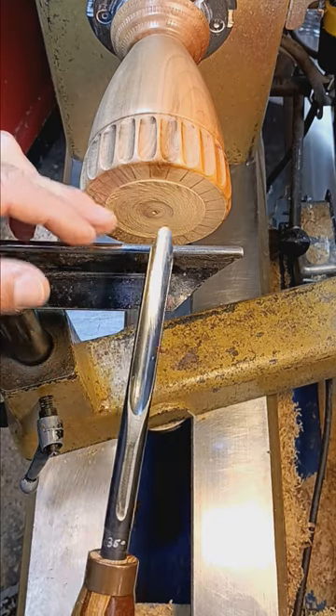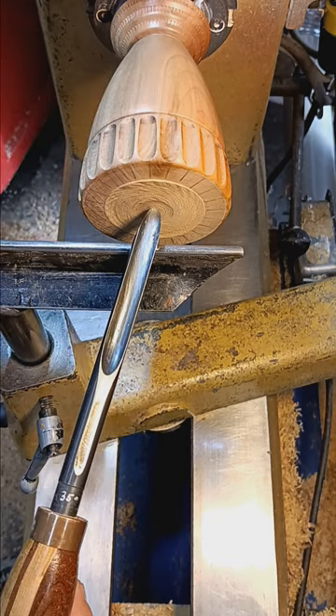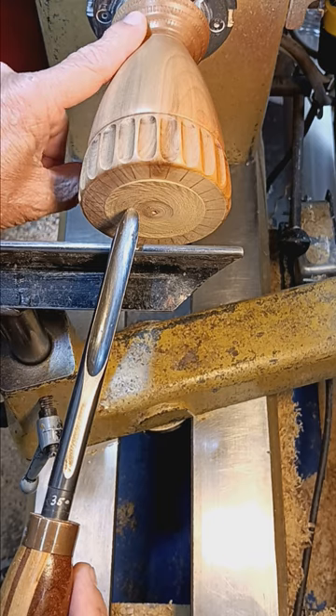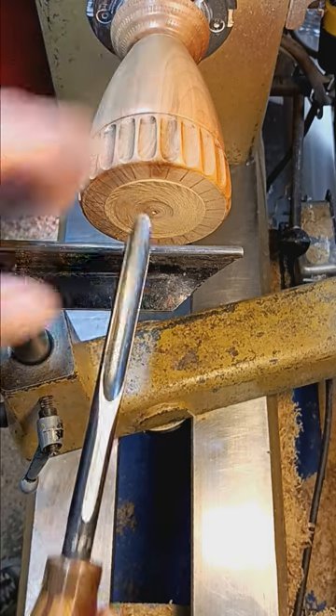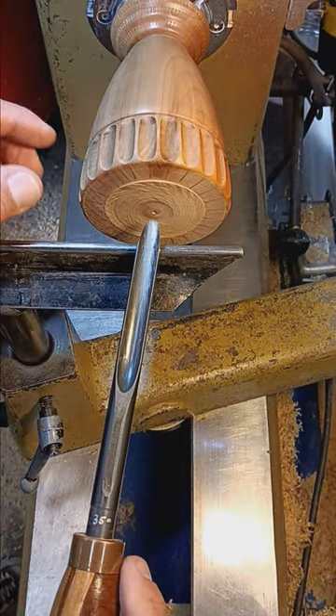So many people are having problems pulling it out of the chuck. The first thing you do, of course, is you have to make a proper tenon and insert it in the chuck. If you don't have a tenon in the chuck so that it can bottom out on the top, the piece wants to vibrate and eventually will come out. So it's good to have a shoulder on those tenons. I'll show that in another video.